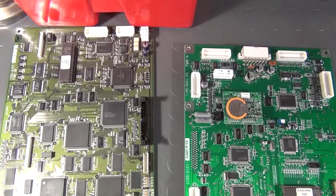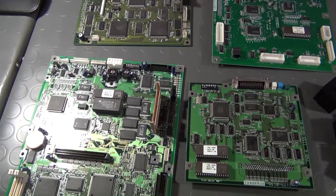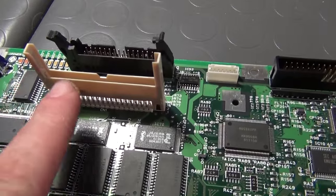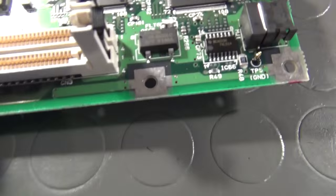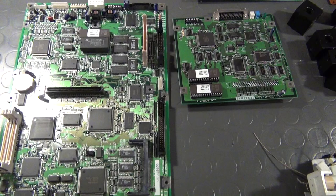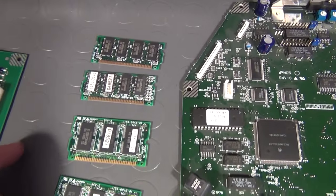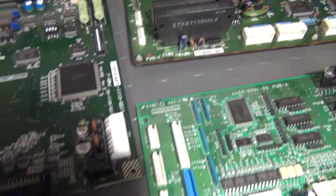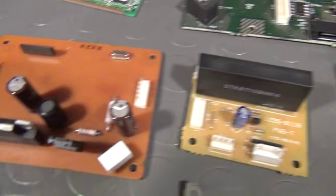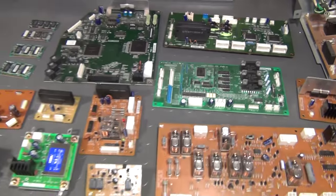What you see here are, for the most part, highly specialized digital control and signal processing circuits with very specific applications. Outdated microcontrollers and other digital devices in surface-mount packages are typically both hard to remove and unlikely to be of any use in future projects. However, this PCB carries various large connectors with gold-plated contacts, giving it a certain scrap metal value. I recommend stockpiling boards of this kind and selling them on eBay. Sometimes you can also find RAM modules that might still be worth something. Some other boards carry both easily salvageable and highly reusable parts — these large black boxes are expensive hybrid devices used as motor drivers and other power electronics inside the copy machine.